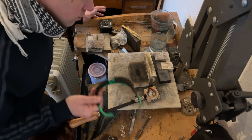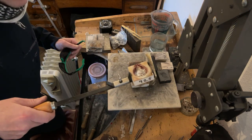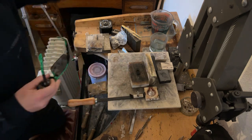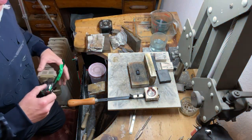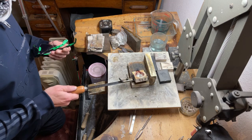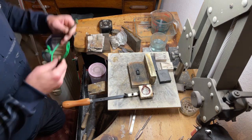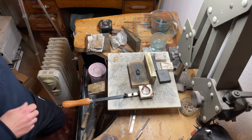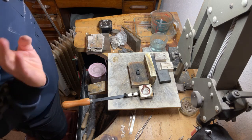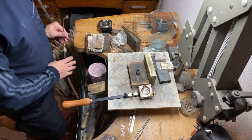I need some nine carat white gold for a job. I've got some nine carat white gold in this crucible, and a little bit of borax flux. Got a tiny little graphite ingot mould there on the go. So we're going to heat this, heat the mould up, melt the gold, pour it into the ingot — that's the plan. Using a Smith's little torch for that. It's absolutely freezing in here, so this should warm things up. I thought I'd do this live.